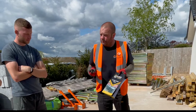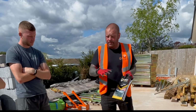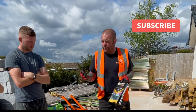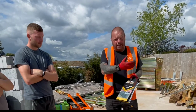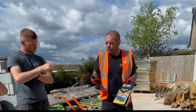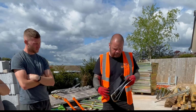Three different systems. We've got the G-deck standard system, which you've got today. That's a 600 kg per square metre loading ability. It can be freestanding, multi-lifts, you can make it into a trestle, a tower, or just a working platform dependent on the project you're working on. So it will replace scaffold birdcage internally, and as long as you've got a flat level surface outside, you can get up the side of the building as well in a tower configuration. So G-deck standard, 600 kg loading with the abilities that I've shown you.